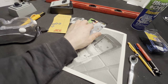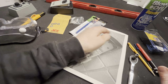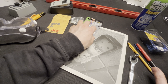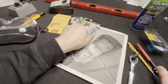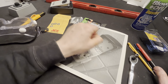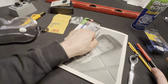What I should have done was use the pin punch — center punch, whatever it's called — so that my drill bit wouldn't wander. It did wander somewhat; it worked out okay but I wasn't entirely thrilled. It was slightly off because of the drill bit wandering, and it didn't stay entirely level. I'd give myself a solid B. So ideally with your hammer drill: one tip I heard in a video is don't just start with the hammer drill — begin your hole with a regular drill, get a little ways in, and then switch to the hammer drill.